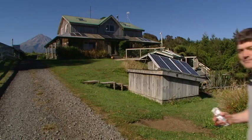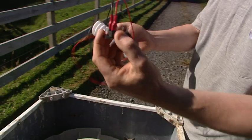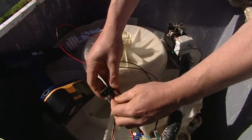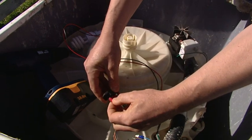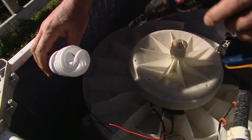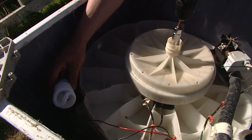So let's do that. I've just got a few tools: a driver to turn the motor, a three-phase rectifier, and an energy-efficient light bulb. All I'm going to do now is put these three wires in any order onto the three-phase rectifier, then move the wires out of the way. I have the light bulb here. I'm going to position the drill onto the washing machine and put the bulb into a dark little enclosure.